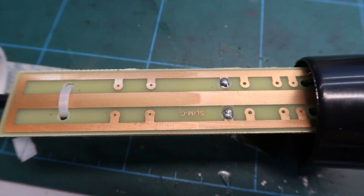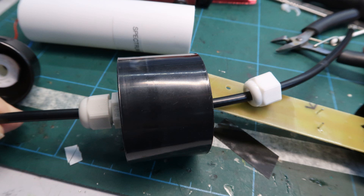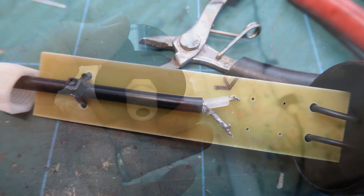Because I wanted the coax to enter via a grommet, I needed to unsolder the coax from within the antenna on its matching circuit PCB. Once carefully done, I was able to slide the coax through the new grommet, the end cap, and the original grommet before soldering it back to the PCB.